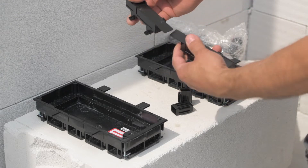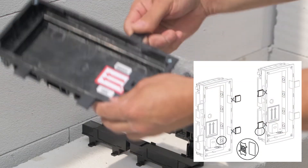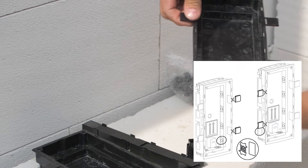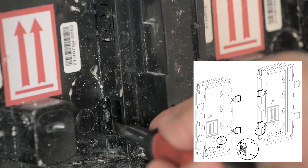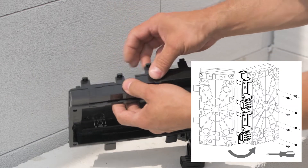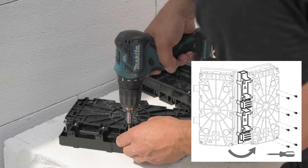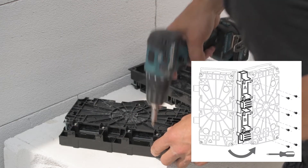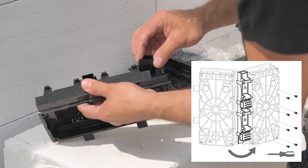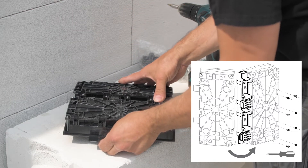Connect the two separators so that the foam tab goes at the top. Break off the inner anchoring brackets as they would get in the way. Push through the tabs to make a hole for the connecting cable. Attach the two separators to the first box and tighten the screws at the rear. Insert both cable protectors. Then click the second box into place and tighten the rest of the screws.